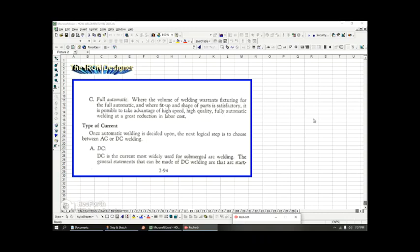Another issue with welding and weld failures is going to be fixturing. You might have a fixture to guide the operator's hand or guide the operator's welding cable or electrodes to try to maintain proximity. It's going to improve quality. But if you have fully automatic, even those fixtures need to be adjusted and you have to have proper settings before you commence forward with the weld.